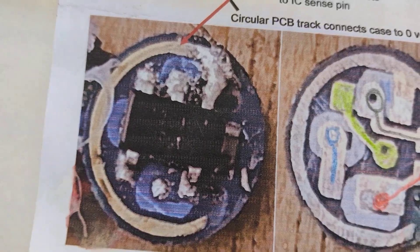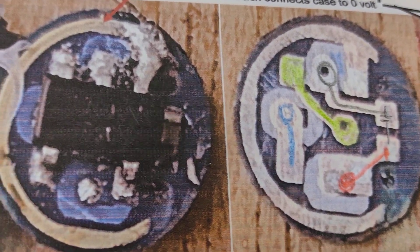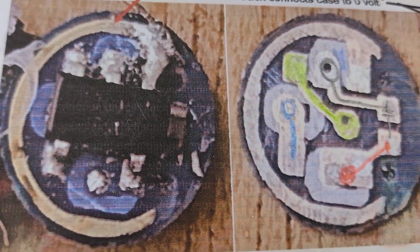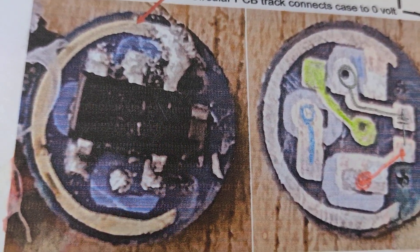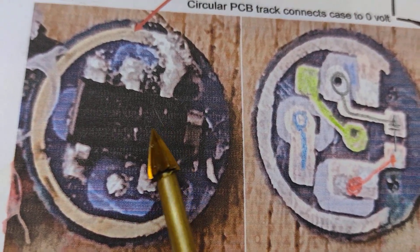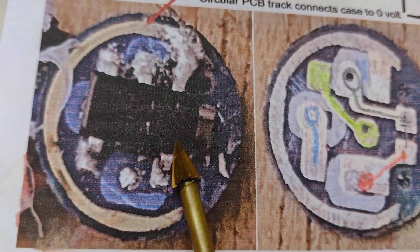In the form of this chip here. This chip protects the cell - down to about 2.5 volts for discharge, and about 4.2 volts for charging. It also protects it for short circuit as well. So it's a brilliant little chip.